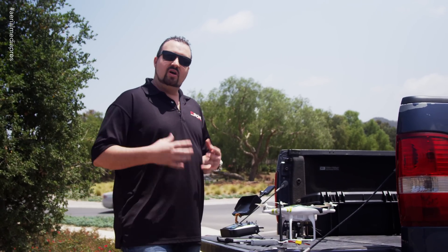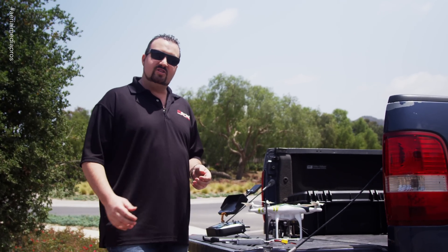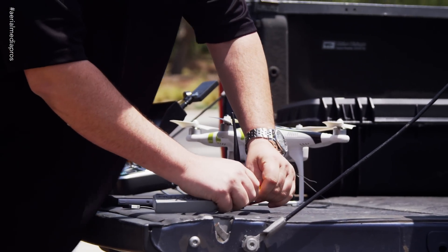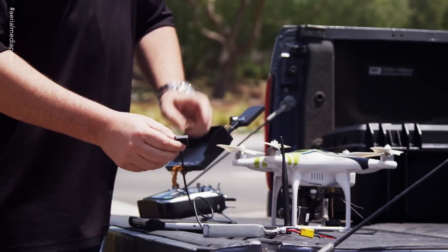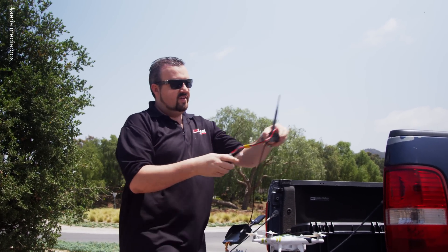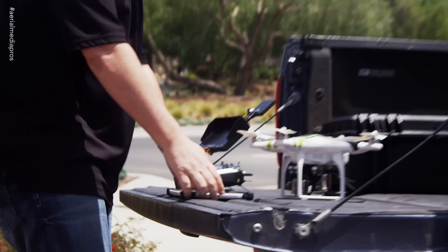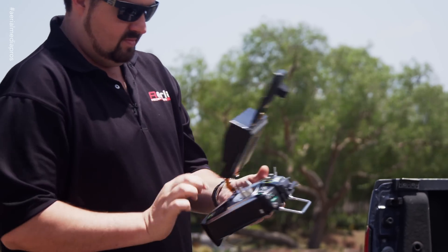Alright guys, I got everything ready to go. I'm going to plug in the data link system, connect to the iPad, connect the copter to the data link, and get everything ready to go. First, go ahead and plug your 3-cell LiPo into your transceiver, the 2.4. Make sure this is powered up because you don't want it to go dead in the middle of a flight. If you really need to get some far distance, you can put this up on a big pole to get better range. Always have your antenna facing up. Now I'm going to turn the radio on — make sure all switches are forward and away. Radio's on.